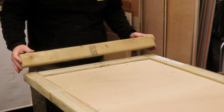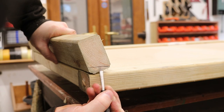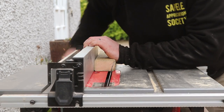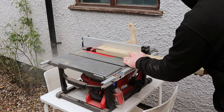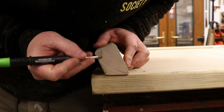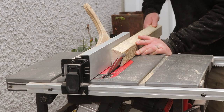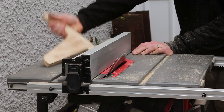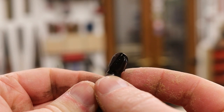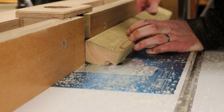This door will need a sill at the bottom just to help it shed water away from the door, and I'm going to use another piece of 3x2 for this. First I'm going to cut an angle on the edge at the table saw. And then I can cut the bottom nice and flat — the angle will be the same here so no need to adjust the angle of the blade. And then I want to cut a little drip groove which will help stop water running back up the sill towards the door. And I have a cove bit which I can use to cut that, so it's back to the router table again.